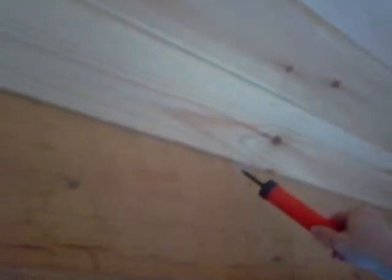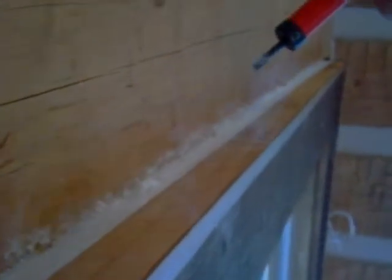And you can see now there's very little air leaking from this area. And also, one of the very first things we did was foam seal the top of these windows. These had incredibly large airspace to the exterior. And now we can see, again, no air leakage.